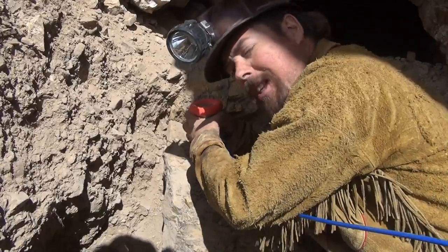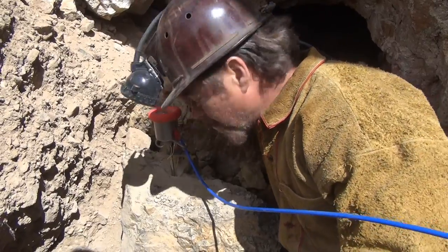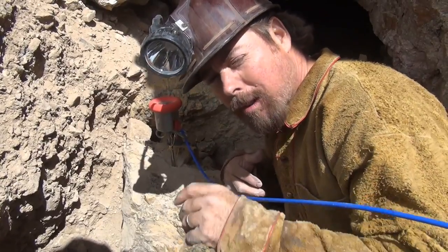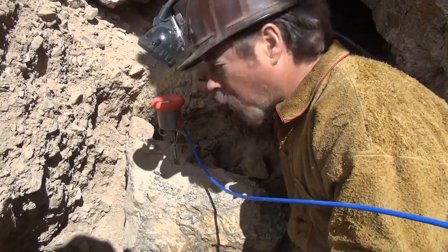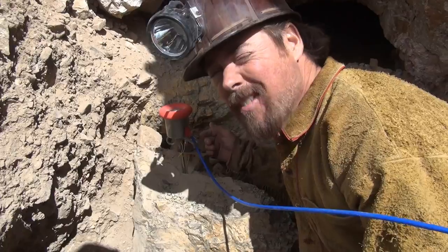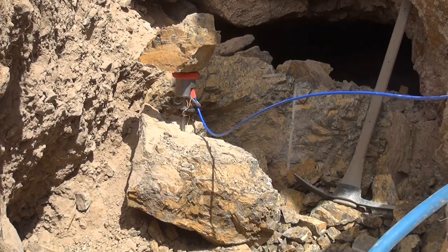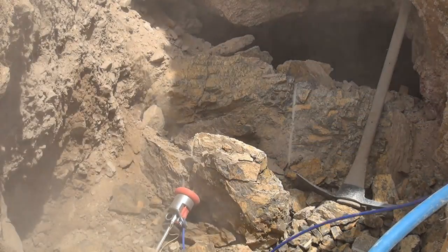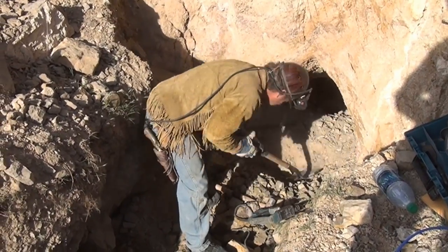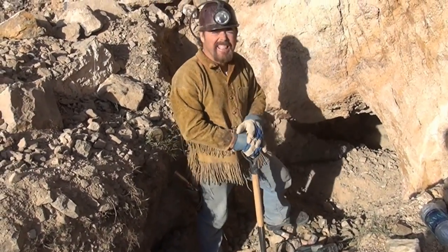Don't put your hands on top — hold it from the side and push down, in case it goes off and pops up. Then put a big rock on top. It's very important there's no air at the bottom of the drill hole, because all the explosive force and the pressure wave will escape through there and you won't get anything. We're going to shoot this rock and get out of the way because it's too big to lift. That really busted up that rock — look at that! Yeah, that's open nice and good.